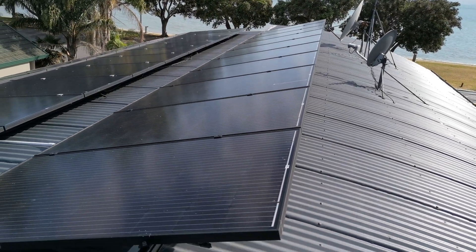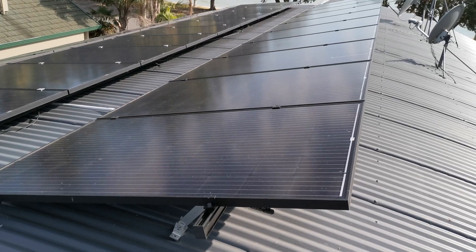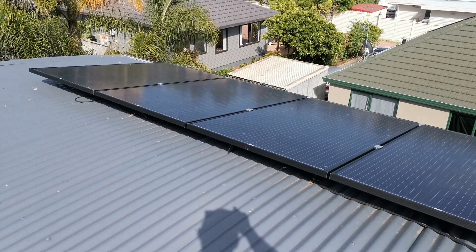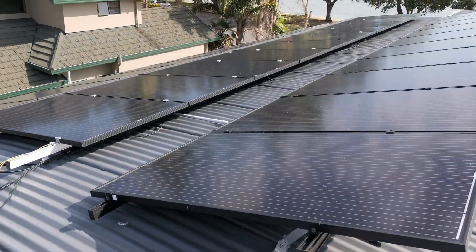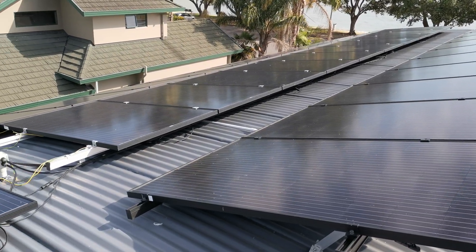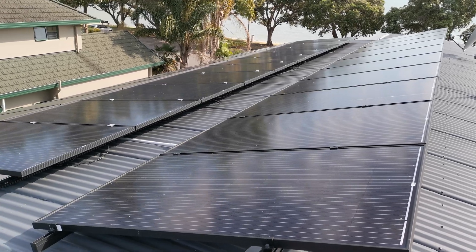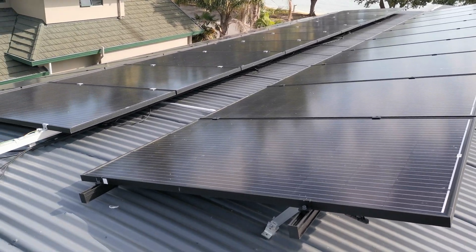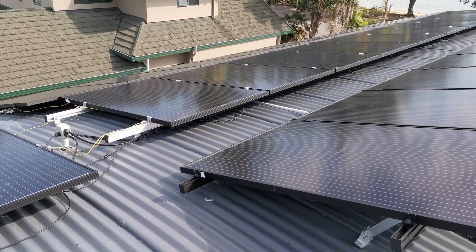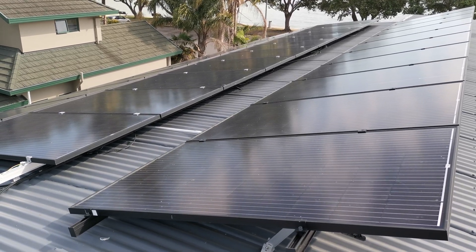With the other ones being in a five-times-three arrangement, I've got three groups of three, and the tenth panel in one bank is connected across to the next two of that bank, making three together. You can do a lot of this as DIY, but your final connections obviously have to be done by a qualified electrician the minute you start connecting to AC current or connecting into your house.